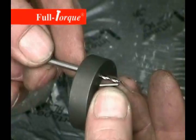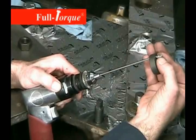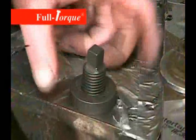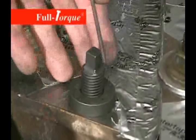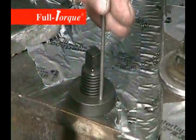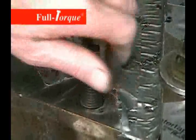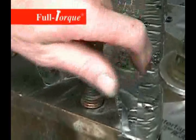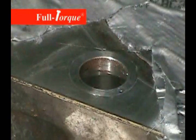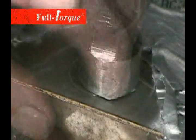There is a drill tube which goes over the drill bit and is used as a spacer to set your depth, giving you the proper protrusion through the washer. Simply locate the washer to the exact spot where you want the locking pin to be. Blow it all off and remove the installation stud. Put one drop of thread locker into the hole for the locking pin and install the locking pin down into the hole. This will prevent the insert from ever wanting to come out the next time the stud is removed. This completes the repair.